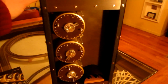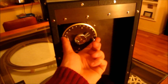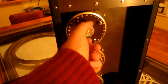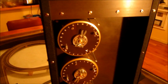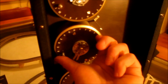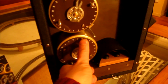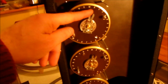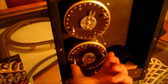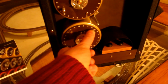So now that the machine is started up, these motors are powered and are holding, which is now why the drums click around. So what we can do is set up the machine to the correct starting position, which is ZZZ. These are actually little finger holds to rotate the drums around. Now these drums are exactly like the original ones, so they will actually come off. These are little spring clips, these little rabbit ear things. And you can take these drums on and off, but because the indicator drums don't need to come off, I just have them attached permanently, more or less.